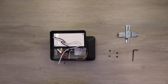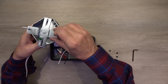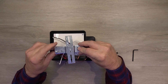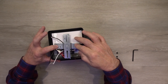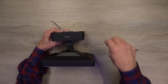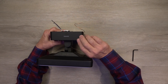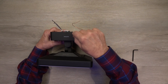Once you've made the electrical connections, take the bracket and mount it across the 4-inch box using those two screws and tighten it down nice and tight. Then attach the light — the two shafts slide down through the two holes and protrude through the front of the lighting assembly. Make sure the wires are tucked down out of the way. Once it's up against the side of your house, put on the washer first, then the nut, and tighten it up, which pulls the base flush against the house. One recommendation: add a little bead of caulking around the outside to make the back end completely watertight.